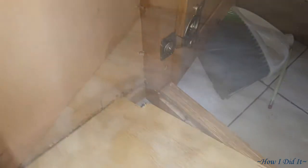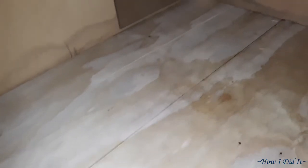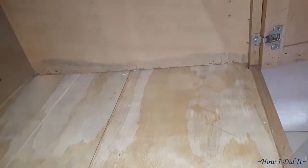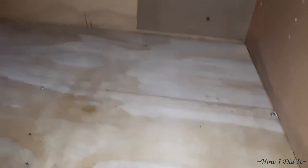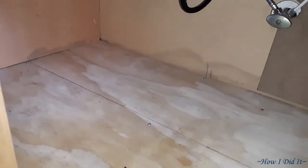The 30-degree bevel cut locked it in down the center, and there was actually another dado on the front that I was able to pull it forward to. So it has solid support all the way around, as well as that piece of plywood that I put down the center. And as you can see, it's pretty flat. It's pretty nice.